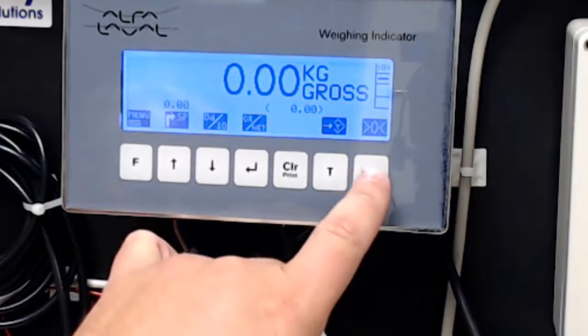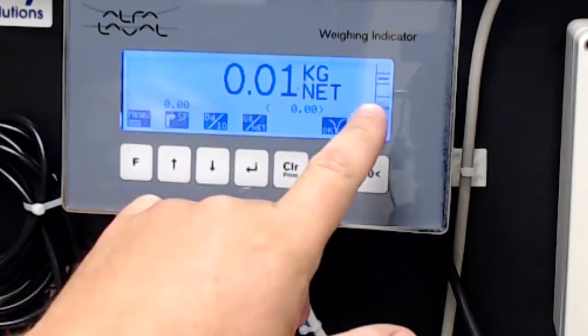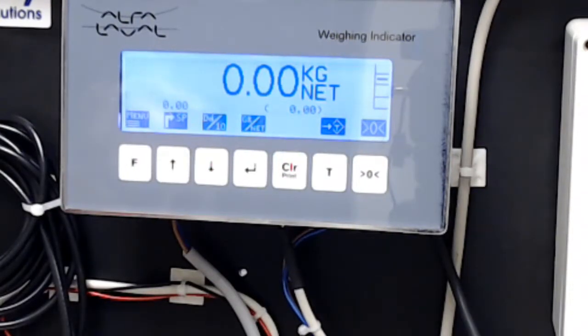The last important button on the right-hand side is the zero button. When you hit this, it zeroes out the display. Prior to starting to fill equipment or add weight to a system, you zero it out so you know where you're starting. There are four status boxes on the right-hand side. The top one is the zero indicator — when the system is zeroed, you get a checkmark. The one below it looks like a straight line. If you push on one of the load cells, that line goes squiggly, indicating the system is not stable — meaning the measured weight is changing. Once it returns to stable, the line straightens out.